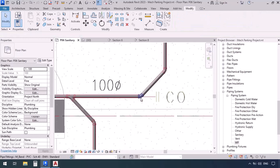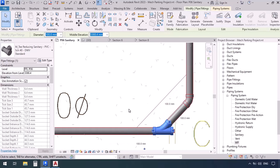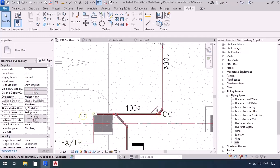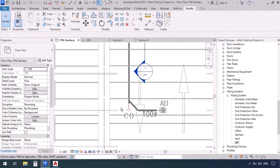Let's also place the clean-outs. Here we have an elbow, so click the plus sign to make it a T, then click 'cap open ends.' Performance-wise it's not necessary to create so much distance between the elbow and the T as in the plan, so we select this T and drag it right as close as possible to the elbow. We also have another clean-out here — select the elbow, click the plus sign to convert it to a T, then put a cap on its end.